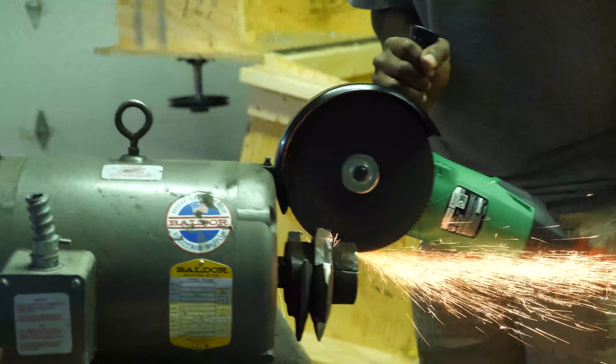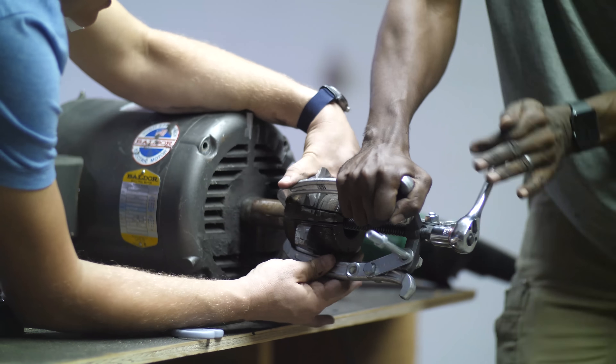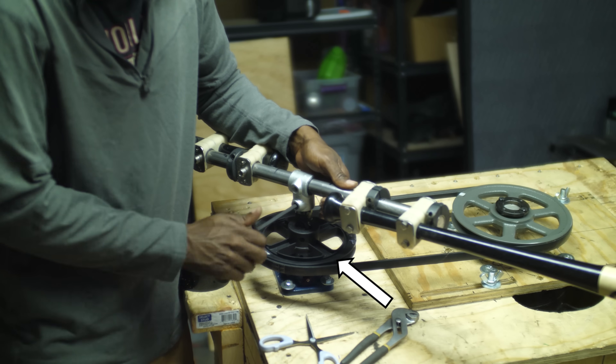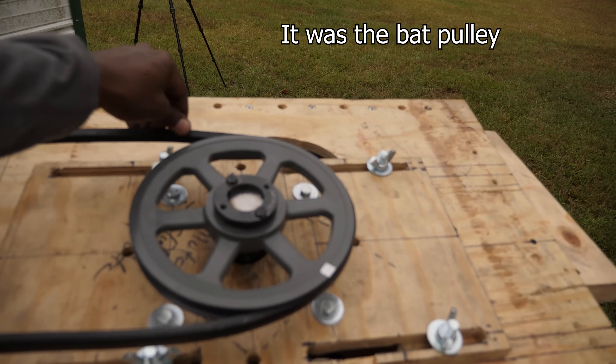When your design is evolving and everything is still in the prototype stage, this is where you have to be most careful. We now had a motor that was significantly heavier and literally five times the torque of the original, and that led to additional challenges we didn't initially expect. For example, some of the early pulleys began to deform because they were rated for 2 horsepower motors and couldn't deliver the power the 10 horsepower motor was pushing through them — I could smell burning rubber.